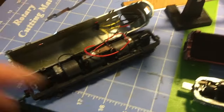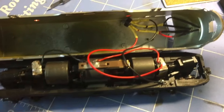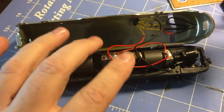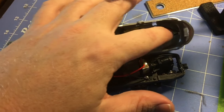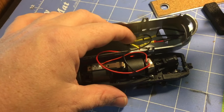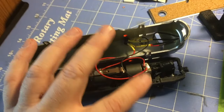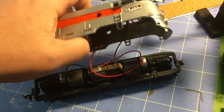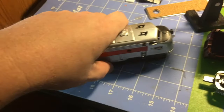Just for an introduction to what we're doing: this is the completed locomotive I just showed you. It already had the mod done to remove the little bar. These two black and red wires are for the LEDs. I've got two LEDs with resistors and a bridge rectifier, which enables the polarity to go back and forth. One wire is picked up off the trucks; the other is soldered to the frame — and that is the finished product.